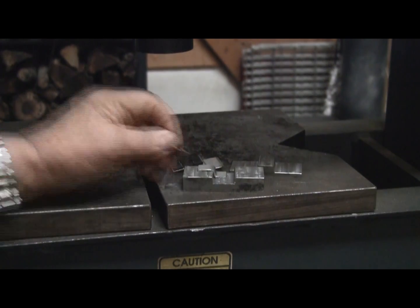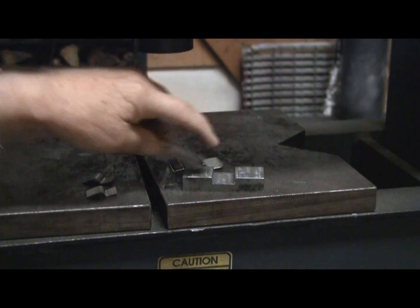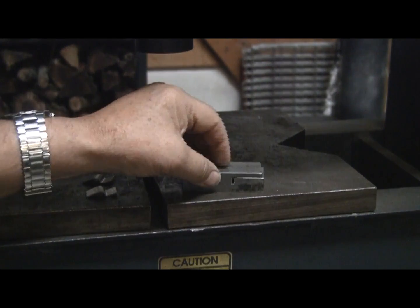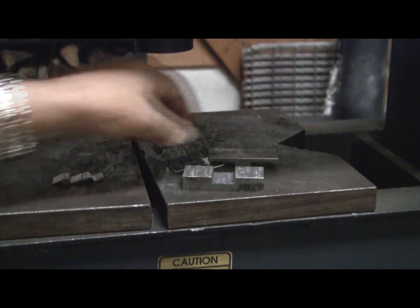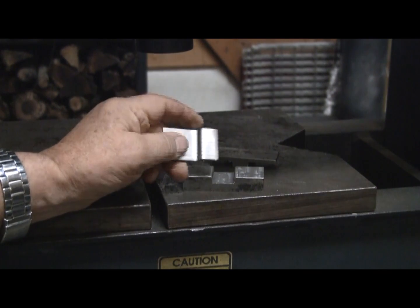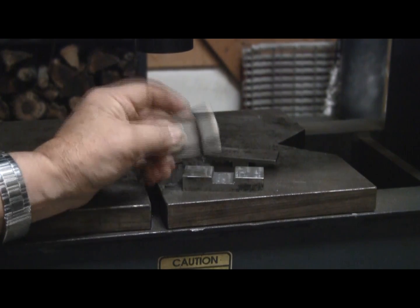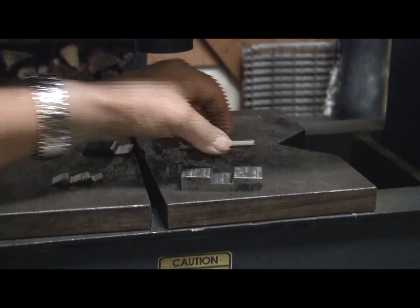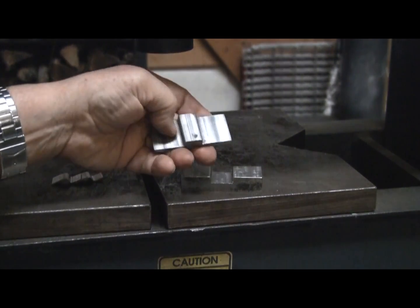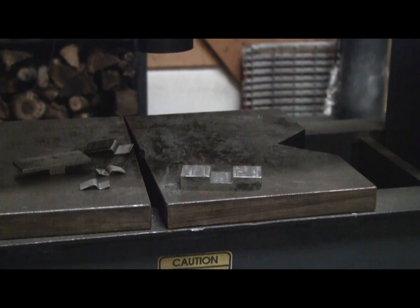Made some little offset pieces, and it's a simple enough die. I had to form it up where it was on both sides and then cut it off — I just formed one long piece, bent it up and sawed it in half. Originally I was making these things years ago, and I used double sided tape because I didn't want to put screws in my motor home. Double sided tape didn't hold, and I still don't want to put screws in the motor home, so this bracket didn't work out. That's what the die — a little punch and die — was originally made for. When you make something like this, you've got to consider your material thickness, and it's got to be bent on both sides in order to equalize the force.